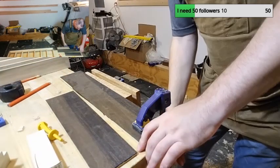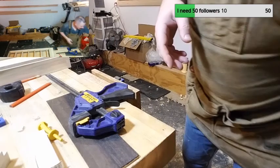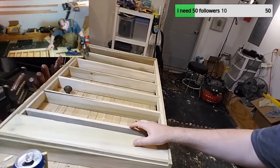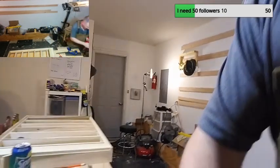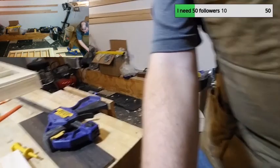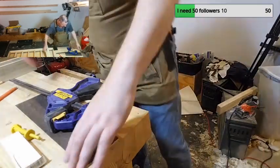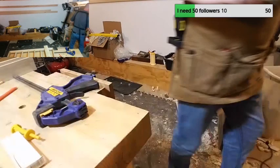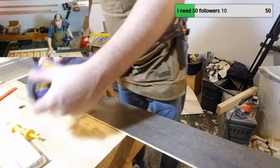And this is just 1/4-inch poplar, stained with a walnut-looking stain. And yeah, that fits in fairly nicely. It's okay to have a little bit of wiggle room in there in the back. That won't be a problem, because it's all going to be properly fixed, nailed down. And I don't think I'm gonna glue the back in place, just nail it in place. That should be sufficient. Well, that is subject to change without notice to anybody. All right.